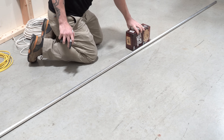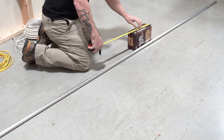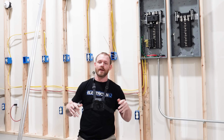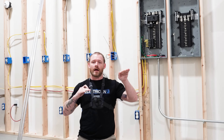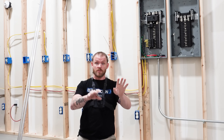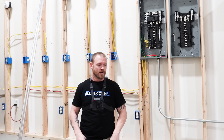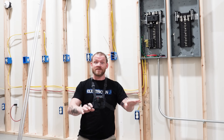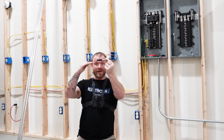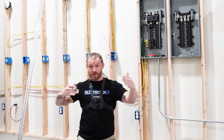The obstruction we're going to jump over is six inches high and nine and a quarter — let's just say nine and a half inches long. I don't deal with shrinkage strictly, so I just round up and give a little extra. When you bend conduit, you have something called shrinkage. Most of us out in the field don't really consider shrinkage — we just add a little bit to fudge our numbers, or we measure for the offset perfectly and account for cutting off at the end to make sure all bends are the same.